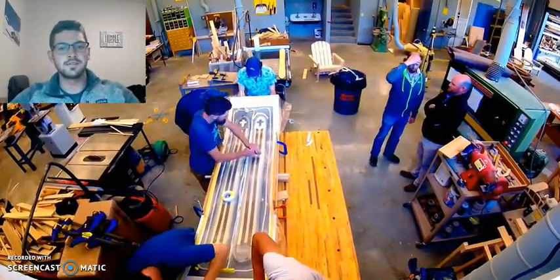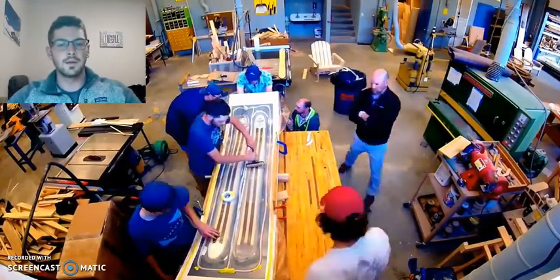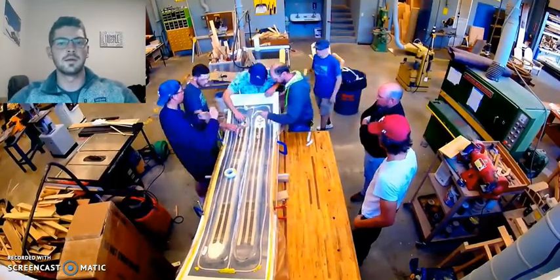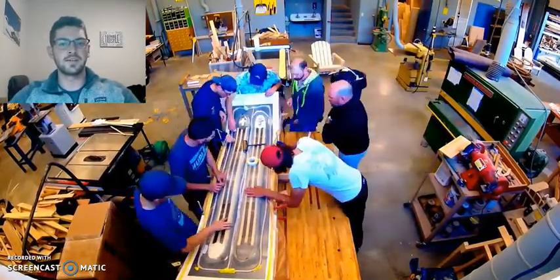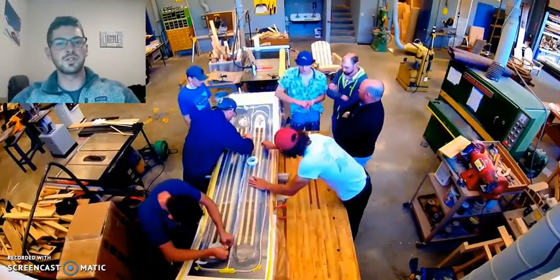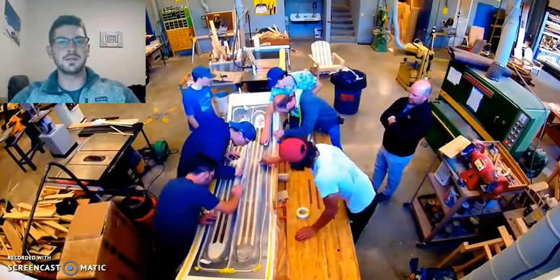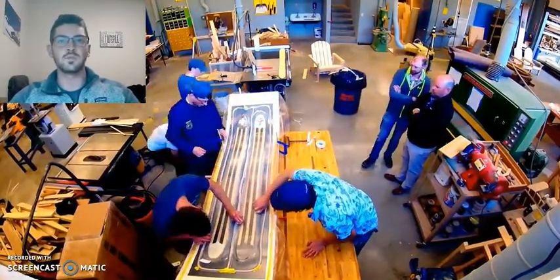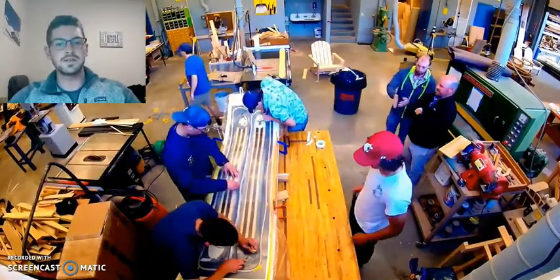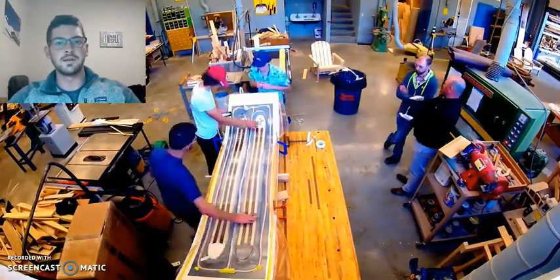Now you can see we are lifting the tips and tails to achieve the desired shape we want. This press also has the lines running along the edges of the ski that you can see, that is where it's pulling all the oxygen. We're also pushing excess epoxy into those lines because we don't want any thick spots in the ski, because it will cause a weak point. We're using the rollers that we could see, and now we're using ball bearings to help get all the oxygen out of the edge of the ski.